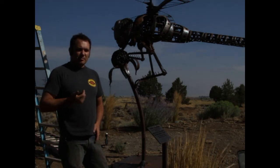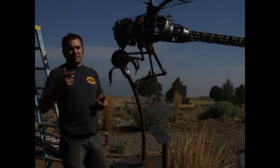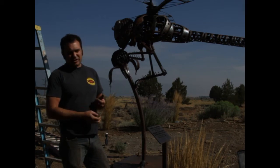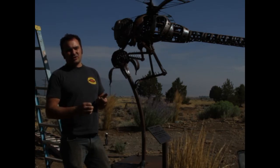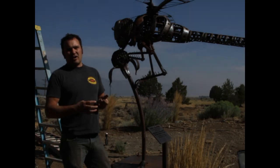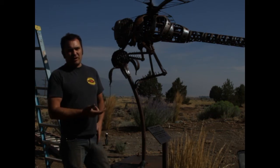It has a buck converter, which is basically a device for lowering the supply voltage so that the Arduino and the H bridges can use it. It's got two H bridges, and what their job is, they're basically like a relay. They take a small control signal and use that to control a much larger high amperage power line, and so you can regulate the speed of the motor with just a tiny little signal voltage.